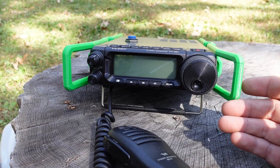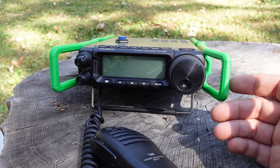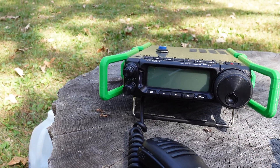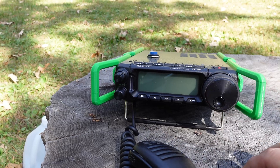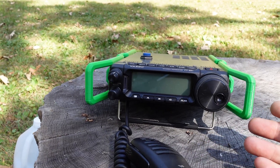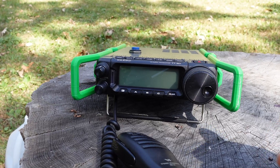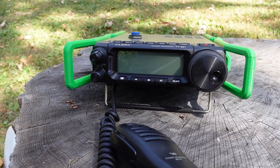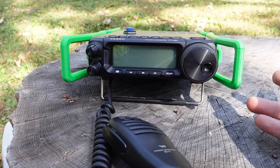With the exception of six meters which is VHF on top, you might notice a button here — this button replaces the FH2 keypad. I have it programmed for one slot so when I hit the button it's an auto CQ caller for me, which will help me save my voice. And of course now we have to have the radio hooked up to something, so we're going to put an antenna up in the air.